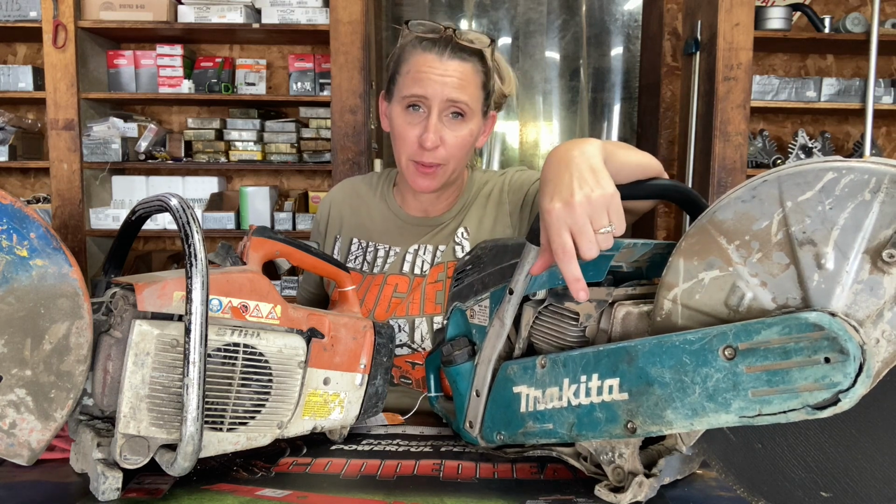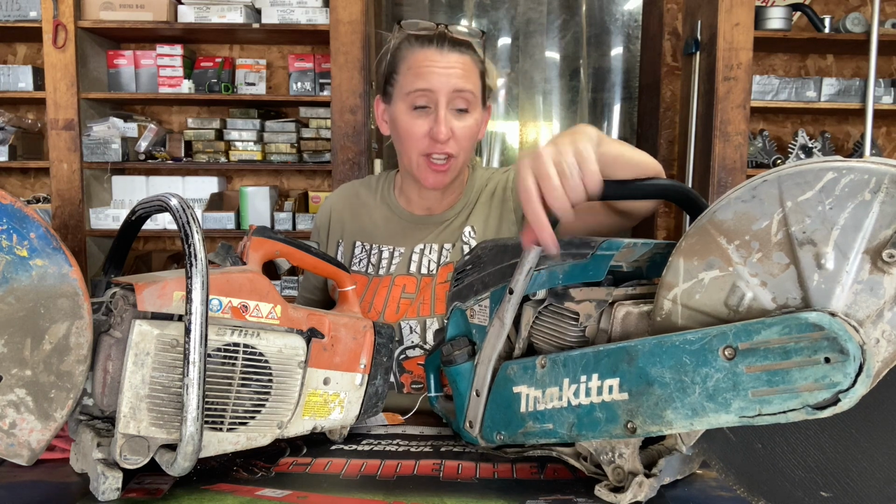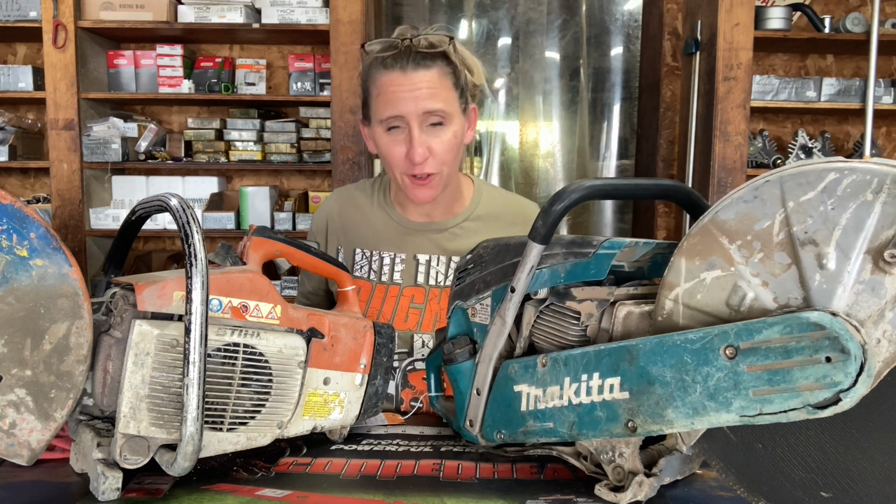So guys, I cannot stress enough, if you're gonna drop $1,000 on a piece of equipment, use ethanol-free fuel, make sure it's fresh, clean your air filter every time, service it, and I promise it'll last you a lifetime.